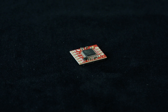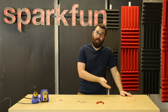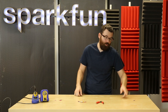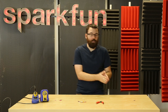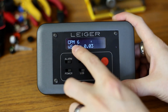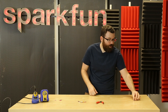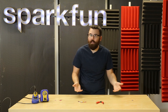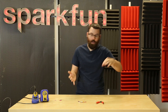Next up is the Open Log — this is probably my favorite product that SparkFun produces. The Open Log is a very simple data logger. On the back we have a socket for a micro SD, and on the top we have essentially a full Arduino, with a header on the side that matches the footprint of the FTDI. It's just a simple logger for any data coming across the serial line. When I went to Chernobyl and built the Geiger counter rig, one of these was inside logging all the data from the GPS and the Geiger counter. It hooks up just like an FTDI, so you can pretty much unplug the FTDI and plug this in place of it.